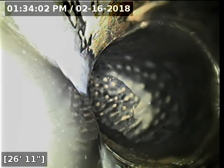Alrighty, so our belly here starts at about 22, 23 feet from the clean out, and at this point here, you can see now that it's drained out, the water level has dropped significantly to less than 1/4 of an inch throughout that spot there. Again, the only thing that's collecting here is grease, which shouldn't go down the line to begin with. Everything else is shooting through that point there, no problem at all. For that reason, I'm not going to recommend any repair on that. It's just too small of a belly.